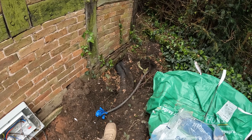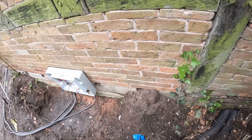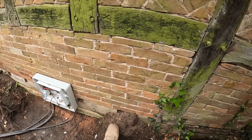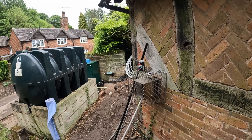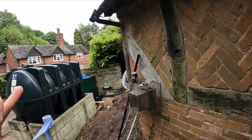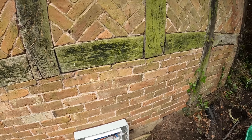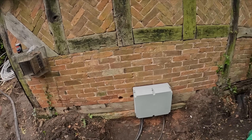Now I've pulled that cable back, I've come up with a game plan — put a rotary isolator on this corner here, gland the big armoured straight into a rotary isolator, and then come out with 25mm or 35mm cable across and straight into another rotary isolator as well. Over there I just need to figure out exactly where they want the two rotary isolators — the two blue boxes on the bin over there. I'll get them mounted, get the two armours made off, and then we can power up towards them. Then the boiler lads can take it from there. I'll nip back tomorrow to sort out that remaining armoured and game plan the inside — where they want the cooker and the little kitchen going.